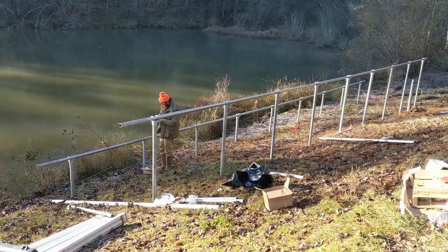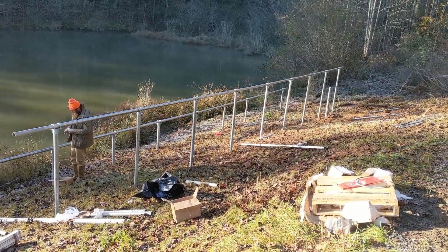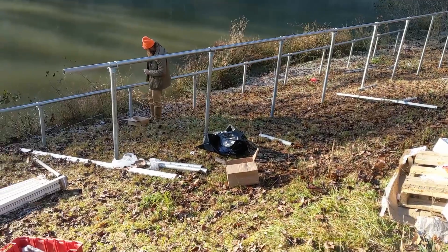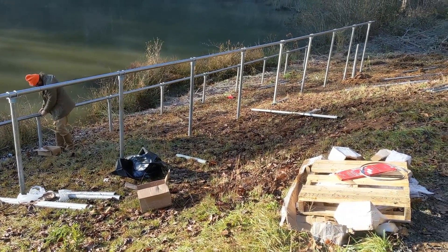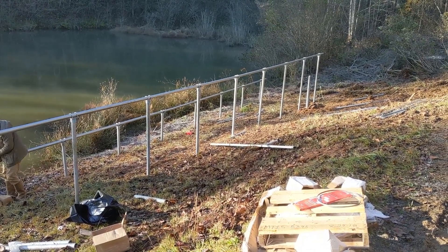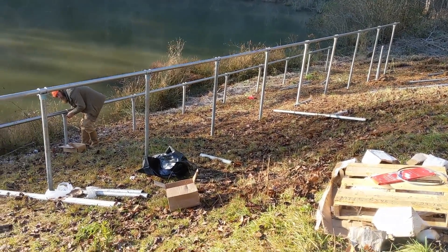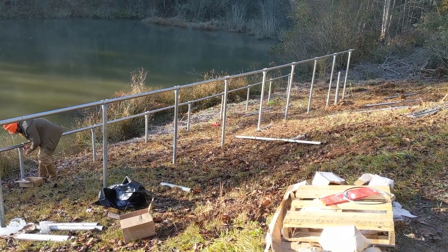It is the beginning of day four. We have been building this Iron Ridge ground mount 10kW. We'll have 36 Trina black-on-black modules, and this is our first time using the earth anchors, so no concrete was used. We drove the helical screws or earth anchors in, and we had a cool little drill rig to drill 36 holes. Then our top rails were spliced — one splice — so it's like 49 feet and some change. We're just tightening things up, and as we tighten it up we see it straightens right out.